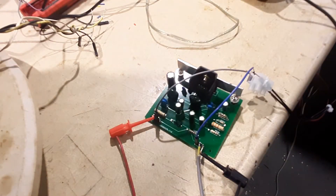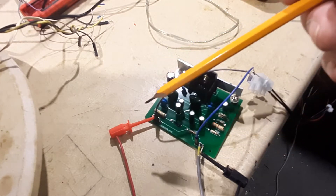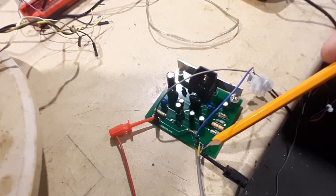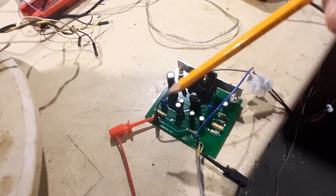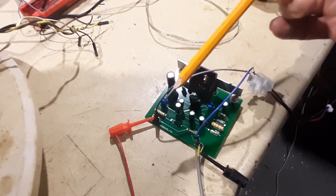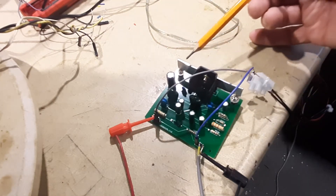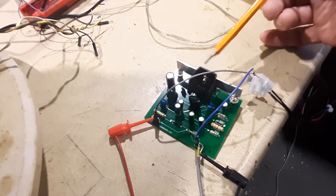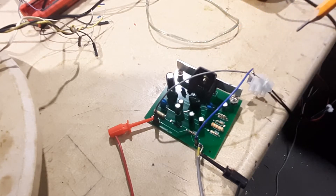Here's the audio output board completed at this stage. I wired it in loosely to the existing input from the radio, and the external speaker is wired here. It's powered separately by these two leads — the black and the red one. You can see I have a homemade heatsink strapped to the back of the chip to dissipate the heat, though I don't think it produces much heat anyway. Let's hear what it sounds like.